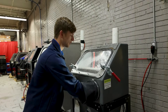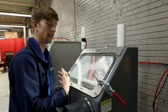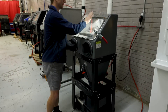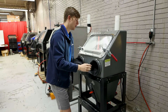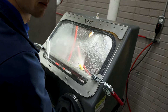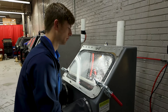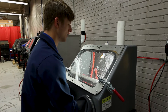Go ahead and grab your blast gun. When you step on the foot pedal, at first the window rinse is what's actually going to spray out to clean the window, and the blasting gun also turns on. The foot pedal is what starts the pump, allows the window rinse to begin its timer, and opens the air solenoid — so you've got your full blasting going on. On the inside you also have your internal rinse, which you can use to spray a part down when you're finished blasting. Do not spray the blast gun at the window to clean it — that will absolutely scratch it. What you can do is take the internal rinse and spray off the window to help see better.